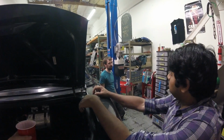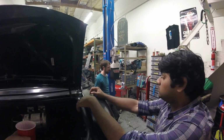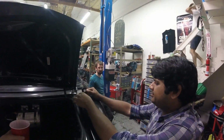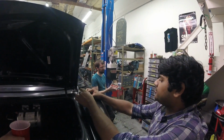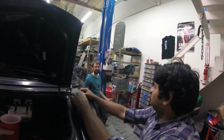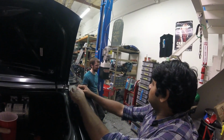I know Dave Wheeler did a dyno shootout where he ran a bunch of different oils. I don't know how it was controlled in terms of variances in the dynoing, but he was saying there was like a several horsepower difference from the lowest horsepower oil to the highest. Yeah, that makes sense. Low viscosity at operating temperature is going to give you more power. He said the highest-power oil was just super thin, and so thin he didn't think it was worth risking an expensive race motor. It was stuff designed for NASCAR qualifying or something, not really for running a car for more than a few minutes. But he said that was what actually produced the most power.